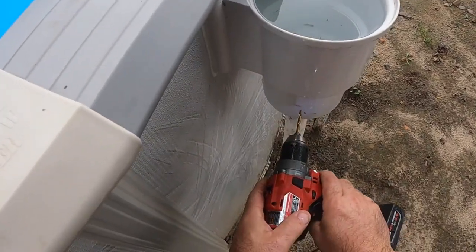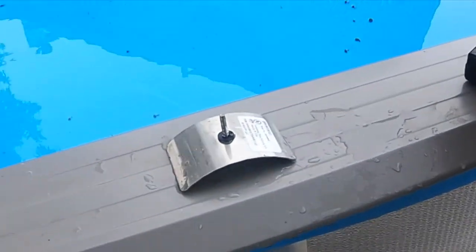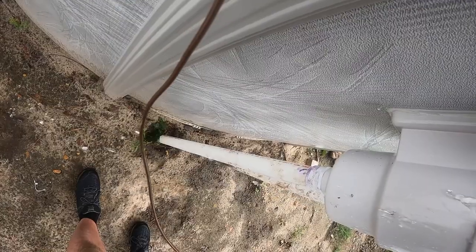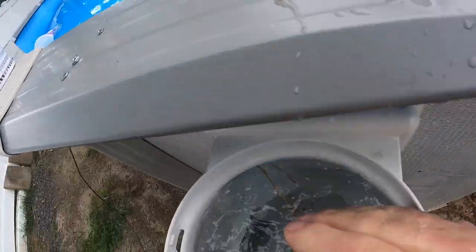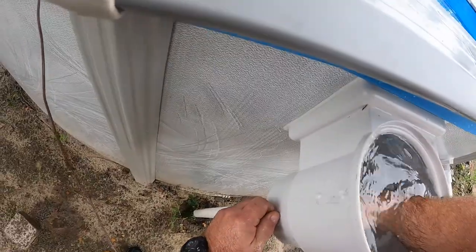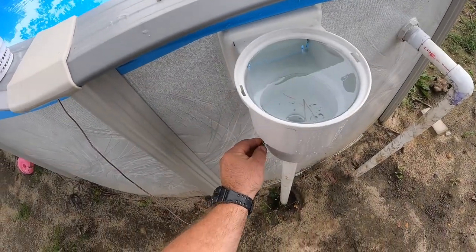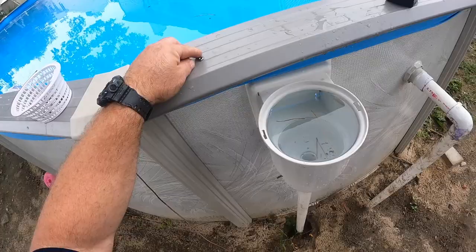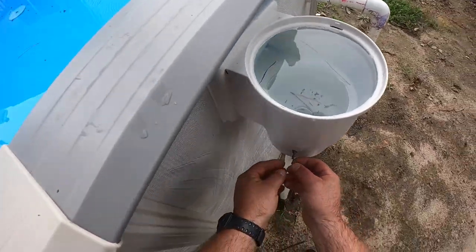I'm using a 3/16 inch drill bit to make the hole. Watch — the water is going to come right out, which is okay, because you're going to put the plate in with the O-ring on the inside and it's going to plug up that hole. Once that stem comes out, you're going to put a washer, then a lock washer, then a nut to make it nice and tight so it doesn't leak. After that, put on the ground lug, then another washer, lock washer, and nut to tighten that up. Then take that bare number eight wire and attach it to that lug — that mechanically grounds the swimming pool water. That's the equipotential bonding grid and the five points of grounding for a swimming pool.